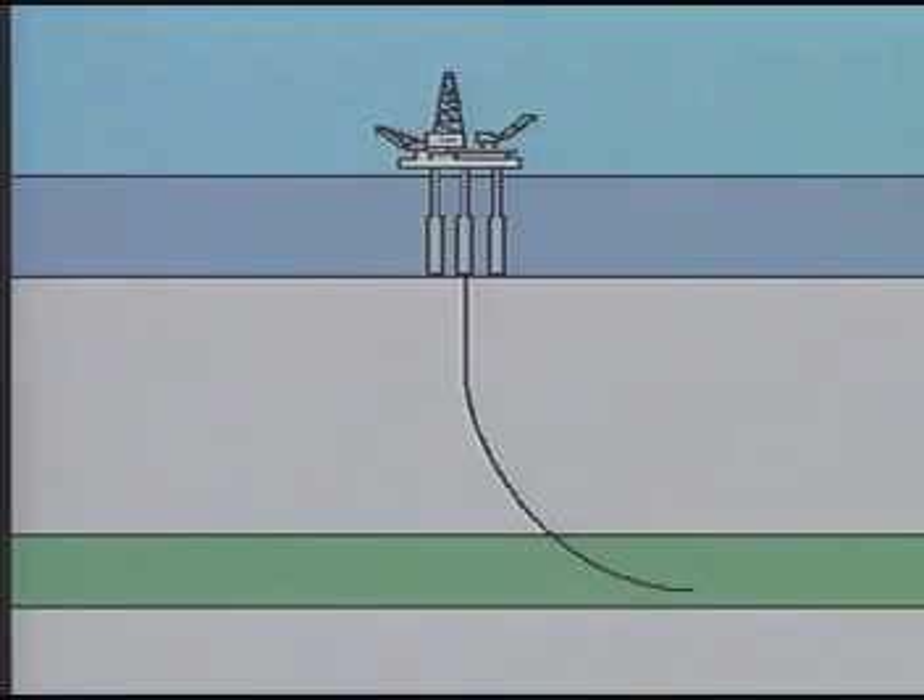When drilling and production is undertaken concurrently on an offshore platform, many companies like to set the valves beyond the kickoff point so that they can be used to shut in the well during the top-hole drilling and kickoff of an adjacent well.